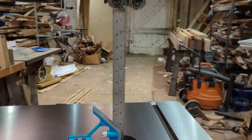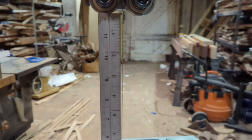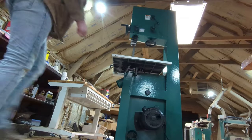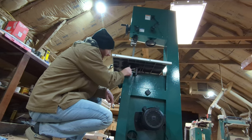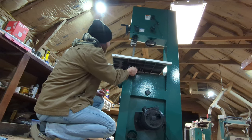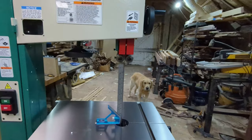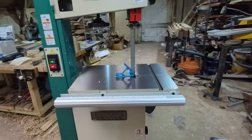Actually we're not quite ready — we have to align the tabletop to the blade. As you can see, we're off by just about an eighth of an inch. To adjust the table, there are two locking knobs underneath — one locks the table in place and one actually moves the table. Adjust until we're nice and square with no gap at the top or bottom, then lock it in so the blade is perfectly square to the table.